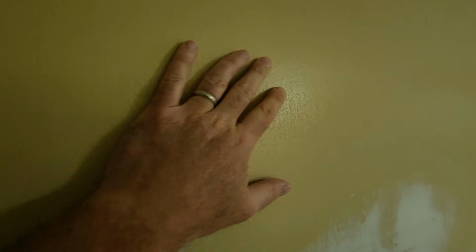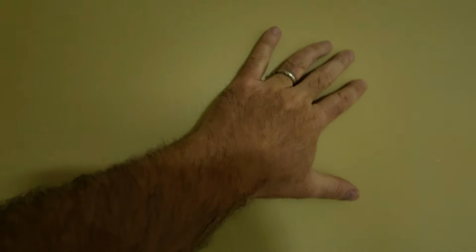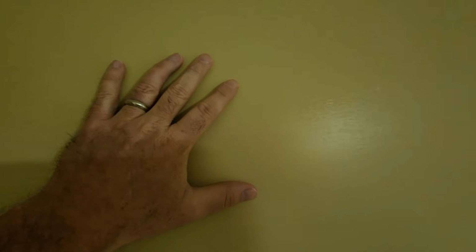We are, number one, sanding the repairs. We have scuff sanded the entire wall surface to promote better adhesion of the paint, and we're gonna get way better aesthetic quality because we've knocked down some of the old application texture too. It's not all gone, but it's been significantly knocked back. So when we roll over this wall, we're going to have a lot more of that consistent roll stipple or rolling orange peel texture, and we'll have really good uniformity on this wall.